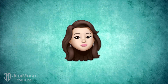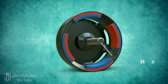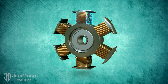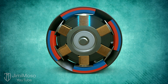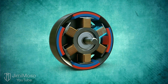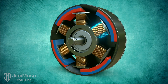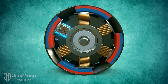Now that we understand the basic principles, let's see how a simple brushless electric motor works. Here's the rotor — it rotates and has permanent magnets. Here's a stator — it's stationary and has electromagnets with their windings and coils. Let's run electricity through one electromagnet. This generates a magnetic pole which pulls this nearby permanent magnet. But just before the permanent magnet lines up with the electromagnet, we turn off the electric current to that electromagnet, and then we activate the next electromagnet which now starts to draw the permanent magnet. This keeps the permanent magnet moving rather than stopping. If we continue this cycle of turning each electromagnet on and off, the motor will spin continuously.